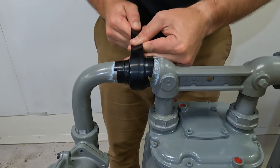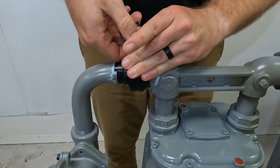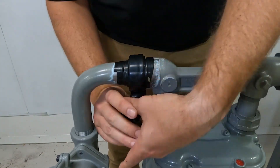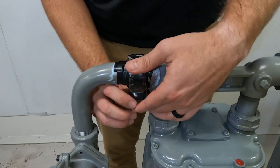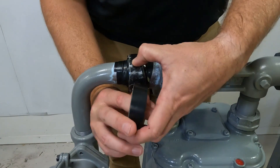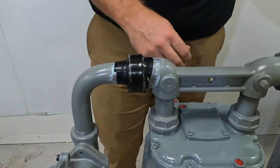There is a strip of adhesive at the end of the roll of pressure tape. When you reach this adhesive, stop pulling the pressure tape at maximum tension, remove the adhesive backing, and install the adhesive section of pressure tape. If you have to start over, consider using electrical tape to help the pressure tape stick to the pipe and the end of the roll stick to itself.